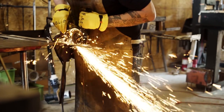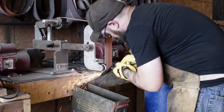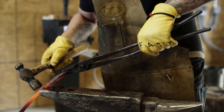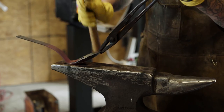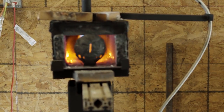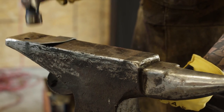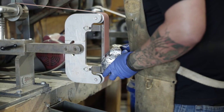The strip of steel for the knuckle guard was a little too wide, so I had to thin it out. Once welded into place and straightened, we throw it in the forge, heat it up, and start our bends. Once I finish getting all the bends roughly where I need them, I'll take it to the grinder, shape in the desired profile, and put in the artwork.